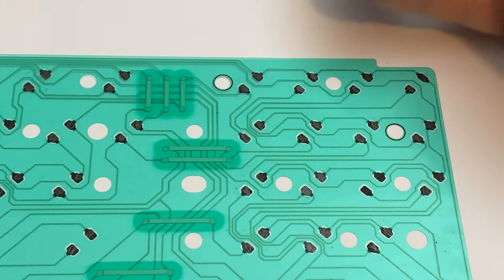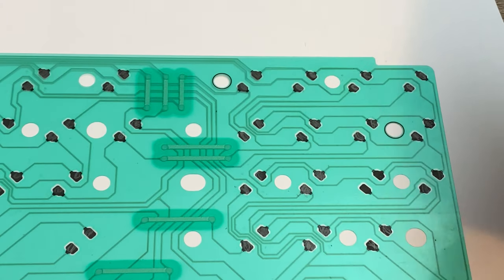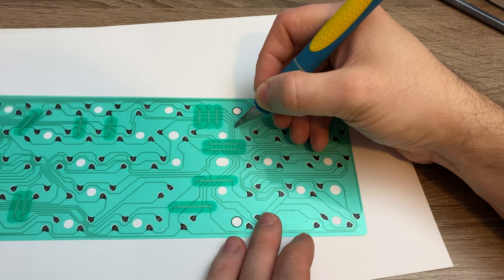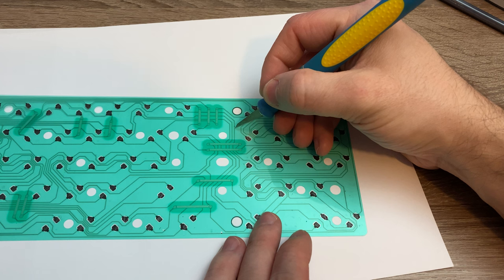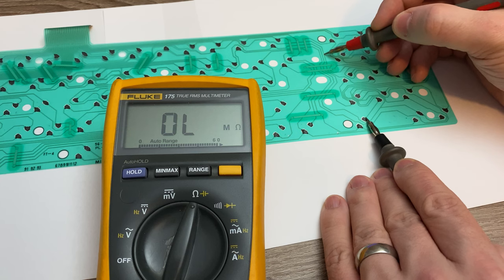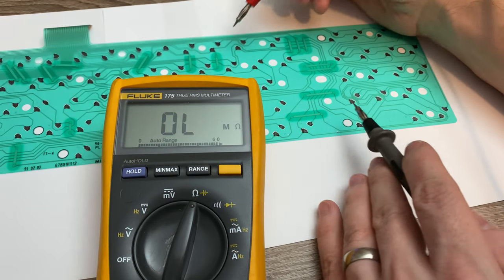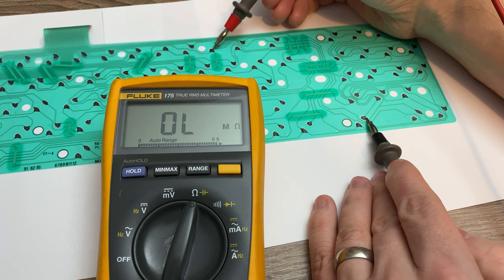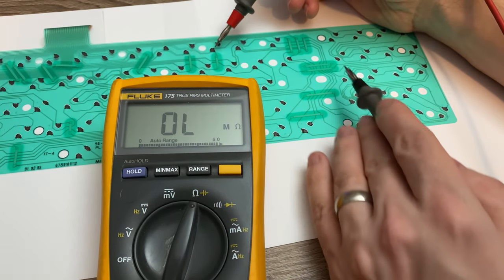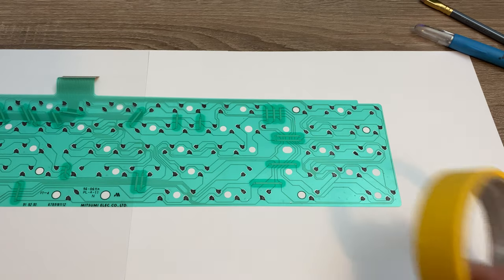I've used silver paint for things like this before, but this time I thought I'd try this liquid wire — a conductive paint that when dried should provide a lower resistance across the break. So I'm just going to scratch it back to expose the wire and check it's actually exposed. That's a more reasonable resistance. It definitely needs fixing now as there's a clean break across. The top part is exposed on both sides too, and the resistance looks good. So now I can bridge the gap with some liquid wire.